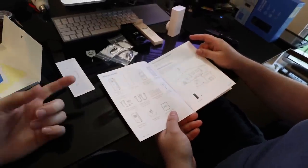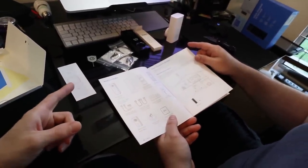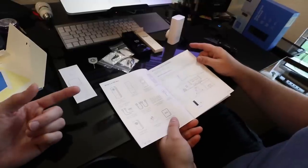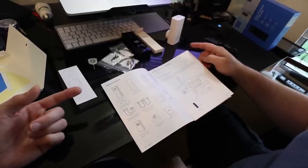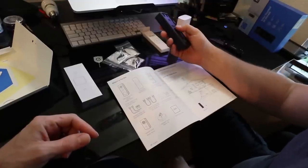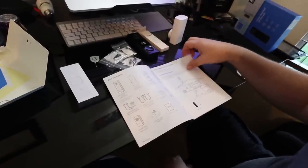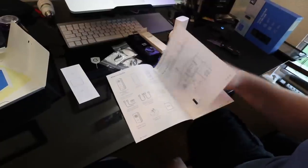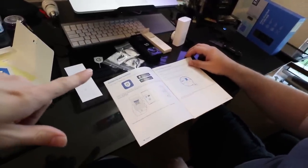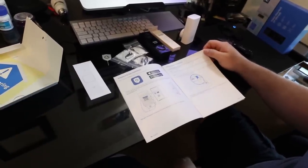The plan is we're going to jumper the indoor doorbell — pull apart the current doorbell and jumper the terminals so that we get 24 volts AC outside. That will be used as a permanent voltage, because usually it only has voltage when you hit the button outside and then voltage is sent to ring the doorbell inside. Once you short the terminals, you get 24 volts AC outside to power the Eufy camera all the time.